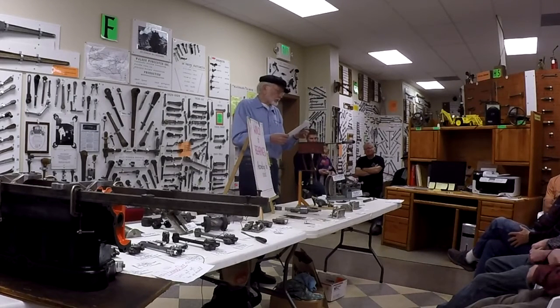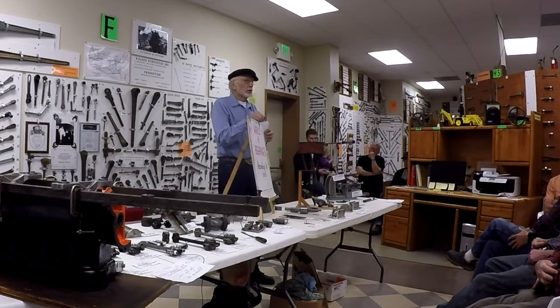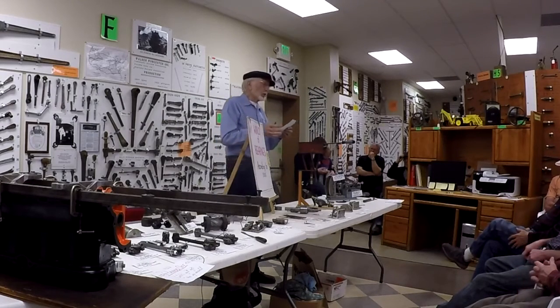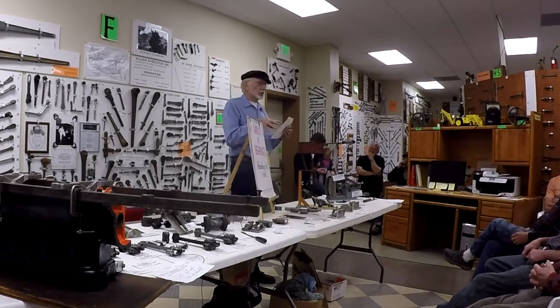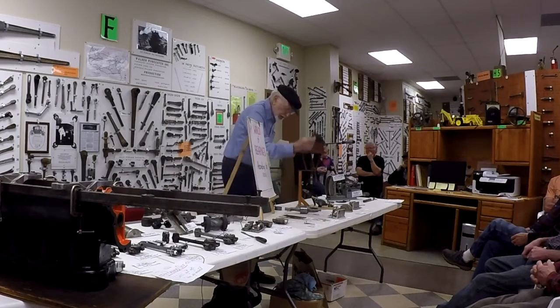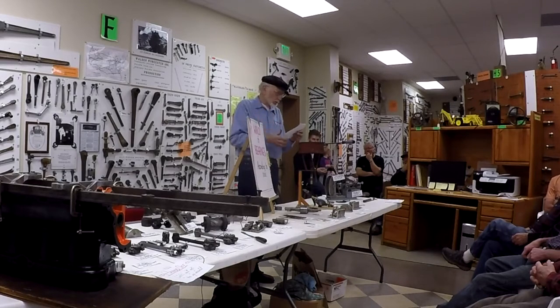Now, the other thing, when you pour, you want to pour with a good stream. The older guys know what I'm talking about. You want a good stream. If you pour too fast, you can trap air bubbles. The Babbitt goes slopping down in there and it rolls up and you got a bubble in there, a lot bigger than these things. Might even be the latter third of the whole damned operation, and you get to do it over.